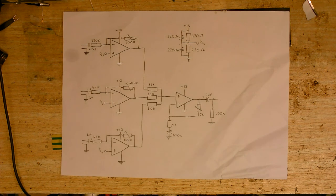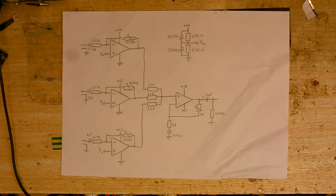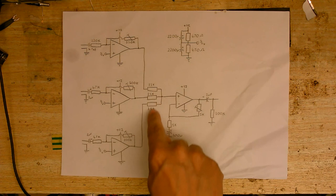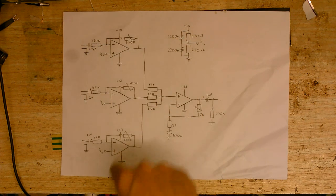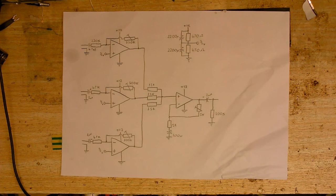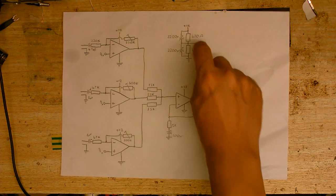We have an inverting op-amp here, an inverting op-amp here, and an inverting op-amp here on each input. I've got three 15K resistors to mix that all together, and then this op-amp amplifies that a little bit and sends it out. The reason I've gone with inverting op-amps is that I want to run this on a single-rail power supply, and it's going to be a lot easier to do it this way. If I'd gone for a non-inverting design, having the signal going into the non-inverting inputs, I would have to bias each one of those separately. But this way I can just have a voltage divider and connect the three non-inverting inputs straight up to that.